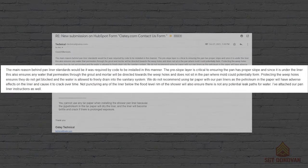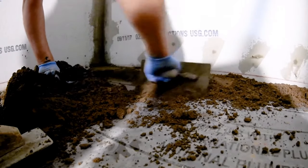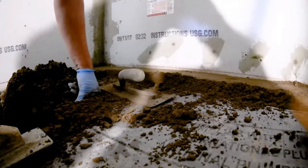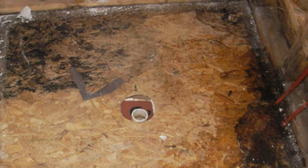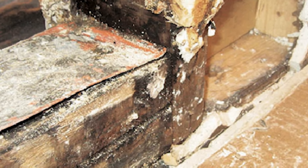While it's true that once your shower pan fails and becomes saturated, moisture will wick up backer board because it has nowhere else to go — resulting in moisture damage to the backer board and the wood framing — the solution gaining the most traction is to not put the backer board in the pan at all. If you keep the backer board out of the mortar and the shower pan fails, you'll most likely keep all of the damage in the pan so that you only have to tear out and replace the pan. I just wish the focus would be on correcting the cause of the failure rather than just a partial reduction of damage. A pan that is installed correctly will never become wet enough to saturate backer board — it was designed to function this way.